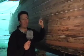If we put a coat on and come back four hours from now and touch it with a cotton ball, paper towel, or rag, and it tears the hair off of it, we can go ahead and recoat it without any additional surface preparation.